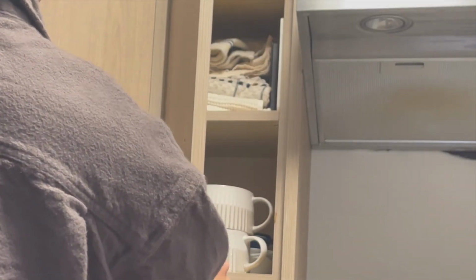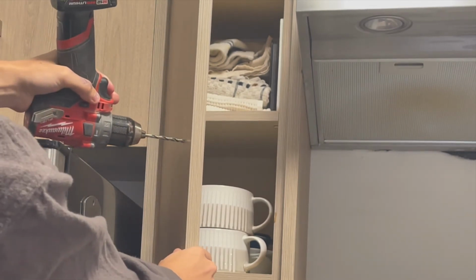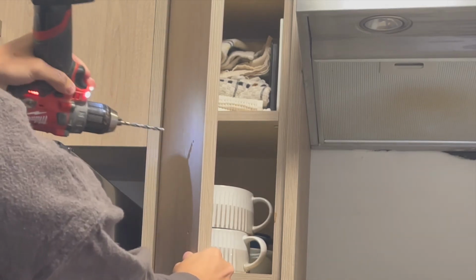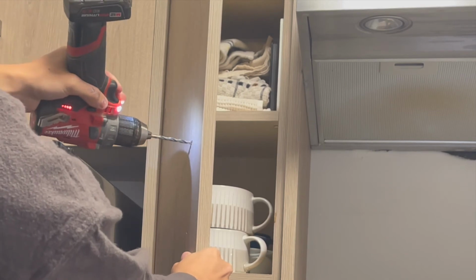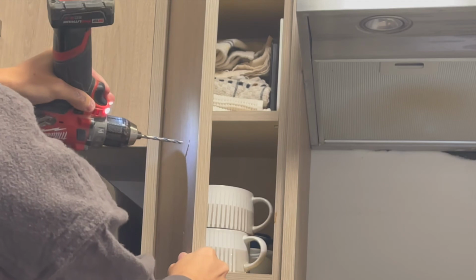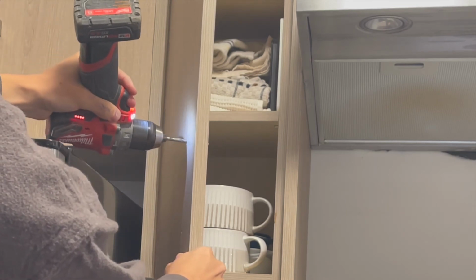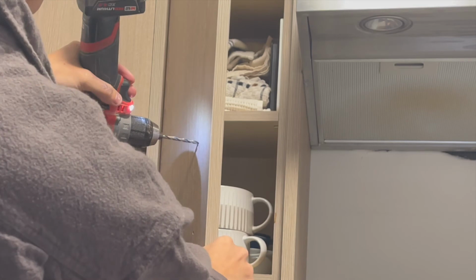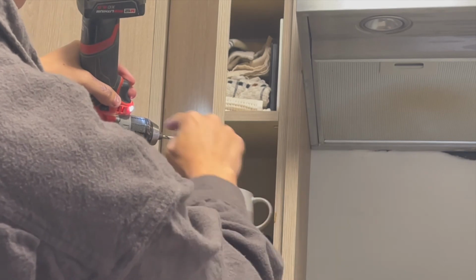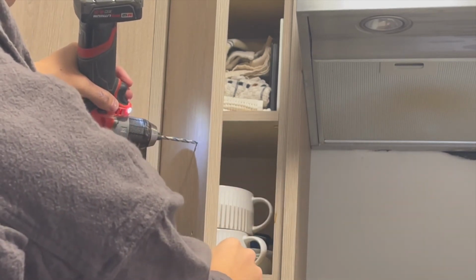The first thing you should know is always drill from the front to the back, no exceptions. The front of the hole is always cleaner than the back. The second thing to know is that you do not want to blow through the holes quickly like this. This will cause the back to break out, especially with MDF doors, and leave an ugly scar. Rather, start quickly, but exit the door slowly and smoothly without too much pressure, like shown in these examples. This will give you a much better result. It is also very important to keep the drill bit level, without angling up and down or side to side. You want to go straight in.